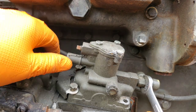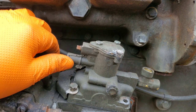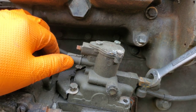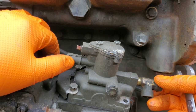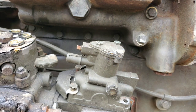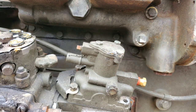Now take this tee out. With this one we can see it was a little bit tight — this is another one where you may want to use a pair of pliers. But the wrench got it pretty easy, and you can fit this wrench around multiple points on this fitting — it was designed to be wrenched on as you can see, fitting between the two 90-degree ports. We got a little bit of crust on the edge but not a big deal. Next step is to put in your large pipe plug — just thread it in and get it good and tight, and you're all set.